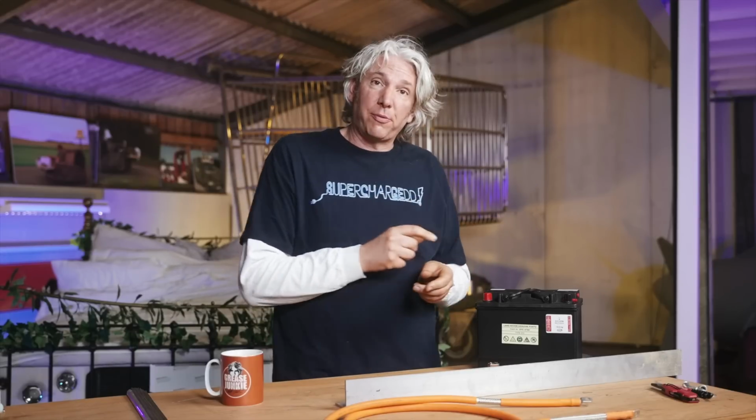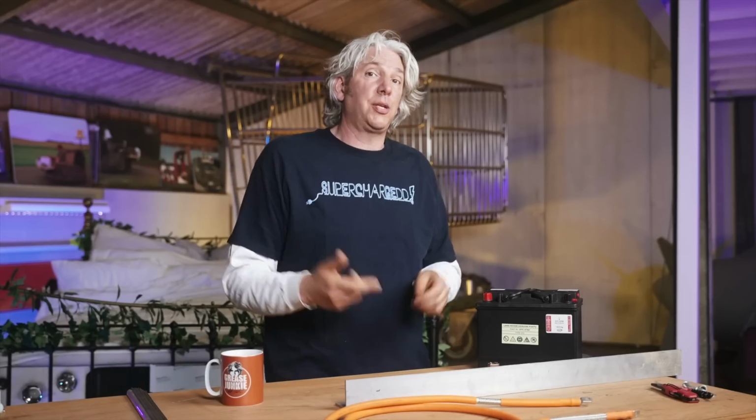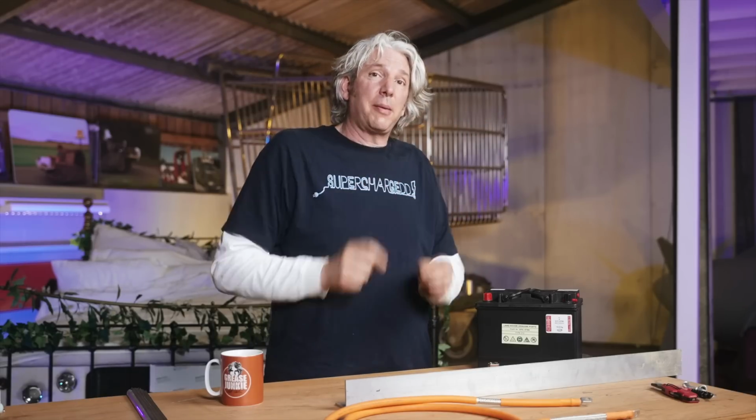So with the right amount of voltage, the current will be able to flow through your body and therefore do damage or even kill you. But interestingly, things like electric fences and tasers use an awful lot of voltage and a tiny amount of current. So maybe 50,000 volts to make sure the electricity does go through you, but a tiny, tiny amount of just a couple of milliamps. And that way, obviously it's going to be really uncomfortable. You are going to fall to your knees in submission, but obviously it won't do any lasting damage.